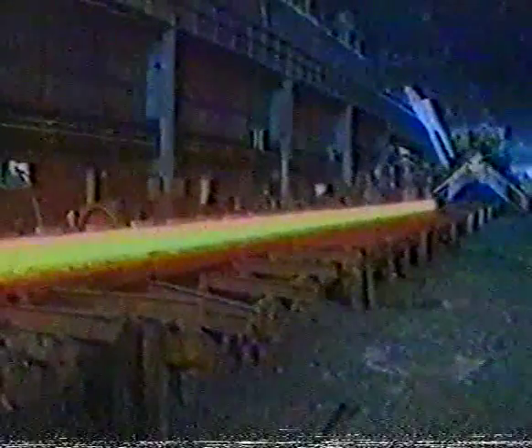After being rolled to size, the ingot — now known technically as a bloom — travels down the roller table to the scarfer. Here, any remaining surface defects are removed by exposing it to an oxy-propane flame. Next, the bloom is made even thinner, passed through a set of water-cooled vertical rolls, then through a set of water-cooled horizontal rolls. Before entering the finishing stands, the front of the bloom is cut off, leaving the end true and square.